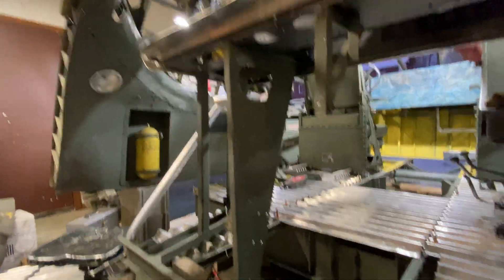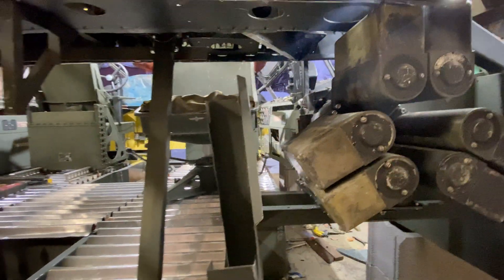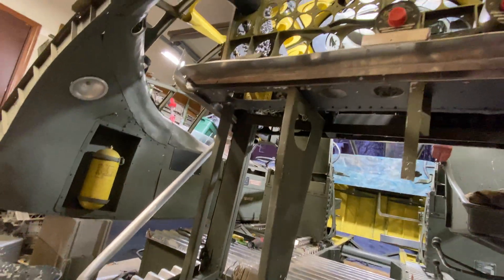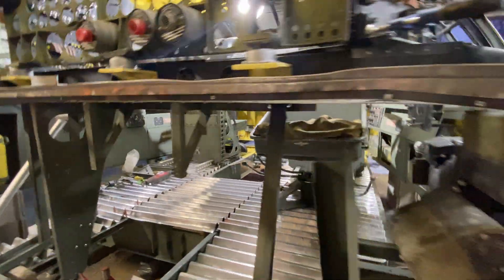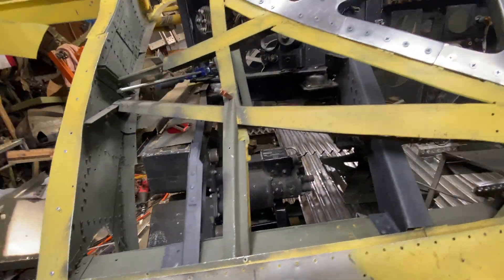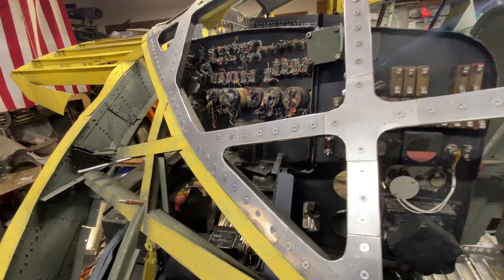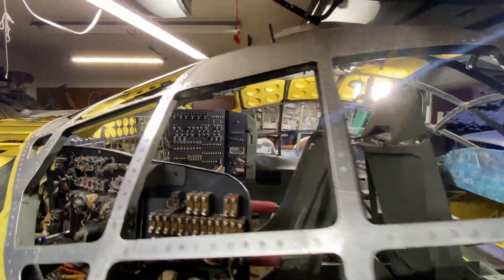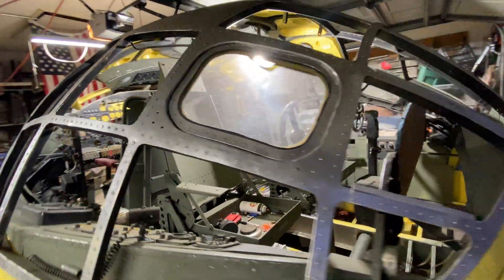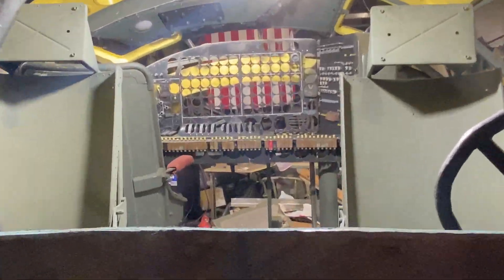There is not a lot about the flight engineer station that I need to get done now that I've got all this — just to build this huge box back here and the braces and the control line stuff, and it's done. It's not going to happen tomorrow though, but we're getting there. I'm trying to replace the pop rivets with solid rivets wherever it's practical; there are places I simply cannot reach, but it is what it is.